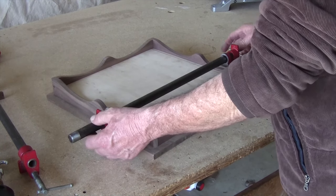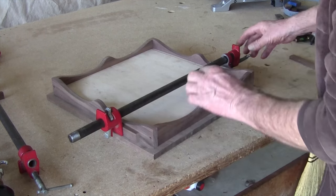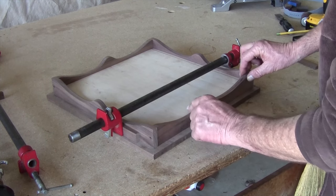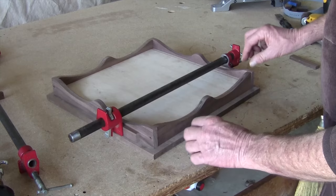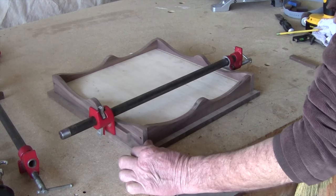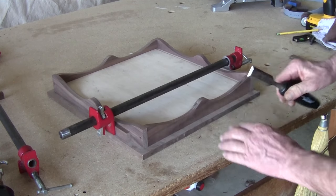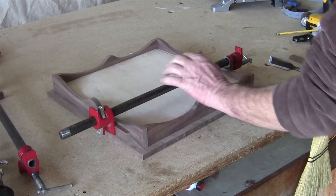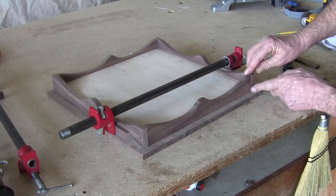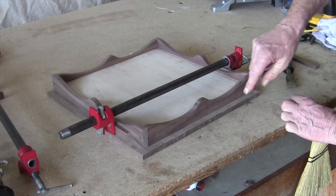All right, so you just barely run it up. Now you adjust it. Okay, it's a little loose, I'll turn it a little more. There, see, it still moved, but it's maybe a little more. Okay, now check. My overhang is probably a little too much here, so I'll just tap it a little bit. Make sure this is down. Check this side. Okay, make sure this is flat. You want it level all the way across.